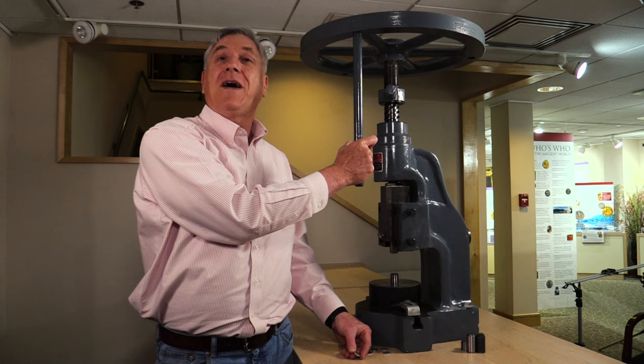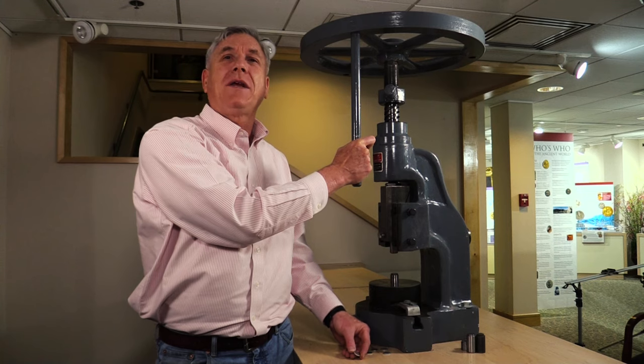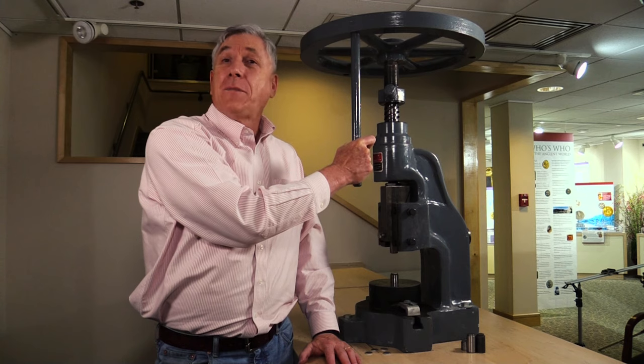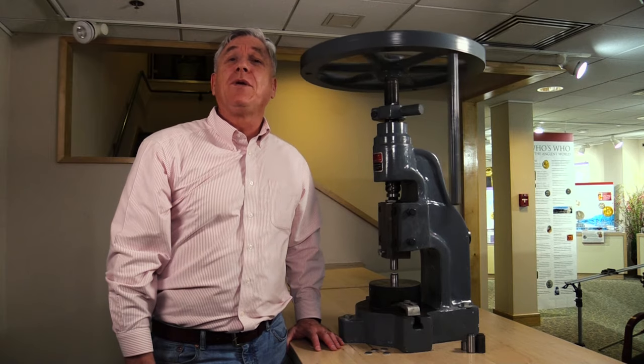The striking press puts the final touch to our new coin by adding designs to the front and back of the blanks, now known as the obverse and reverse. To do this, we place the upset blank between the two dies in the press and then strike the dies onto the blanks, transferring the design perfectly and creating a beautiful new coin.